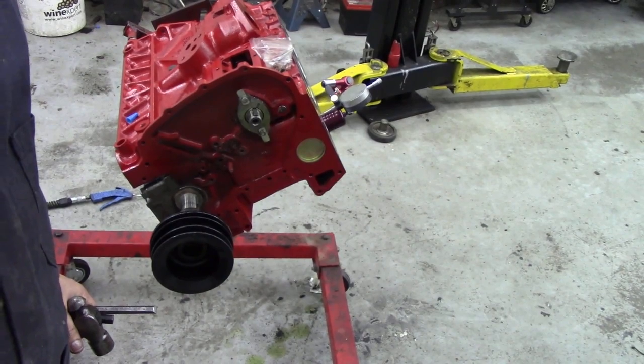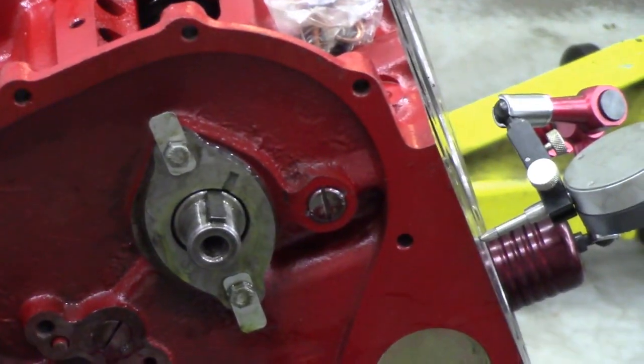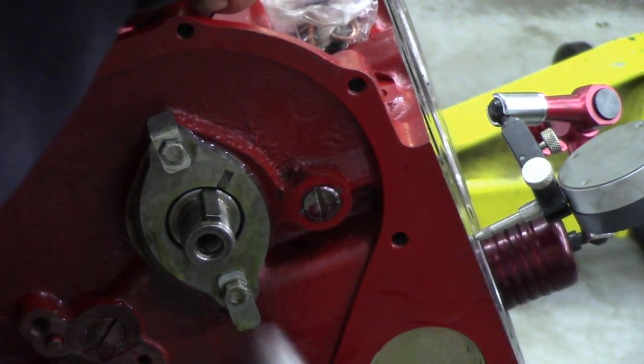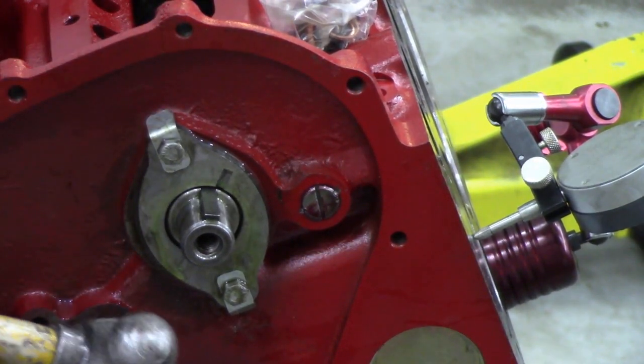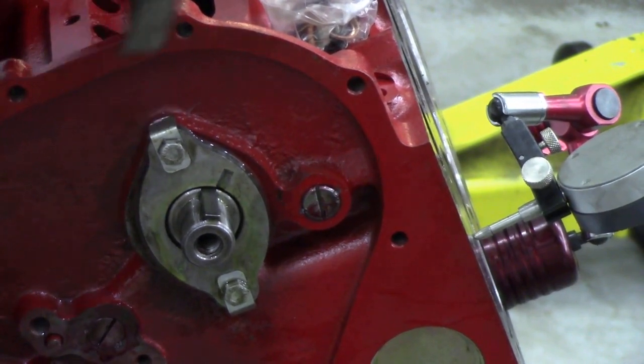Well, naturally there was no torque value for those little bolts and they were metric after all. I think they were M6s so all I did was just tighten them up with a little spanner — just nipped them up with a key. And now we're going to nip over and put the lock washers on. So the lock washers are on there. What we're going to do is just tap them over and finish those off with a chisel so they don't come off.